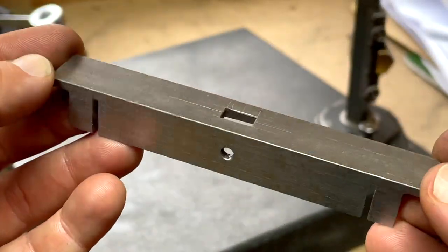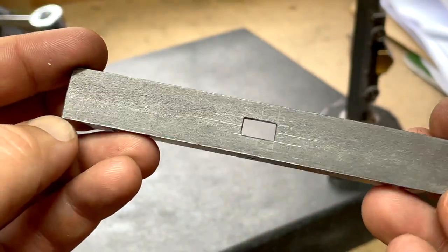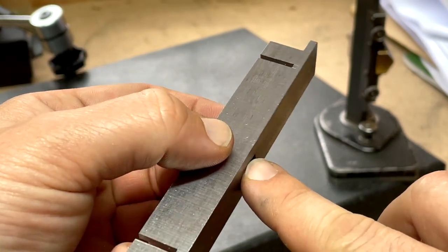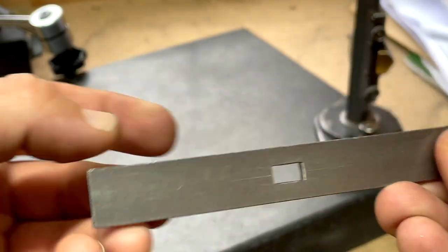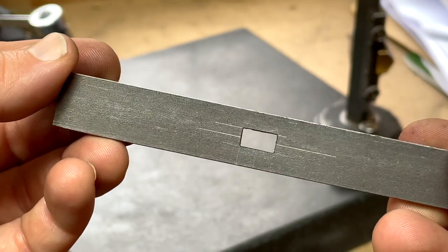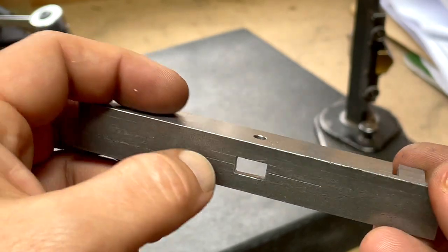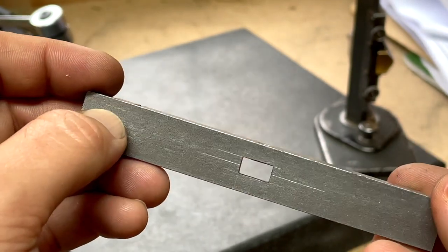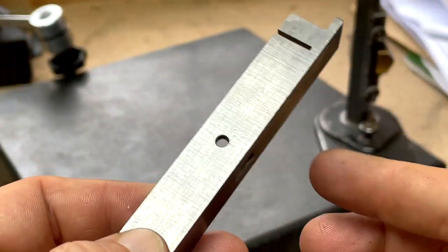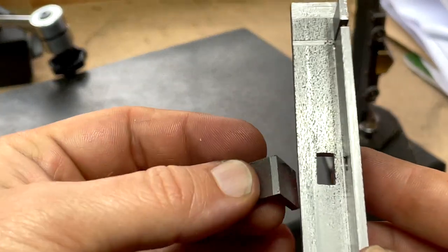What feels like several thousand hours later, we have this one — with the square hole for the connecting pin and link between the tender and the locomotive. That was just drilled out to 5/32" and then filed open with some needle files to the correct dimensions, which should be 3/16" by 3/8" hopefully. And that is a hole for the pin to retain the link with the locomotive.